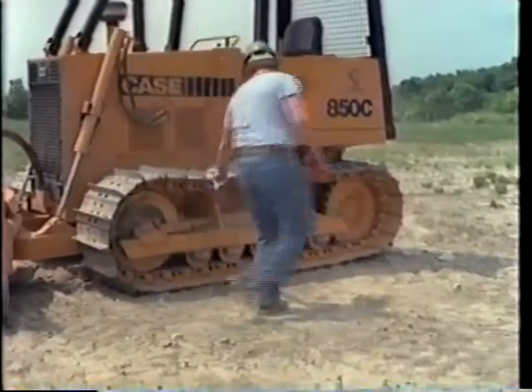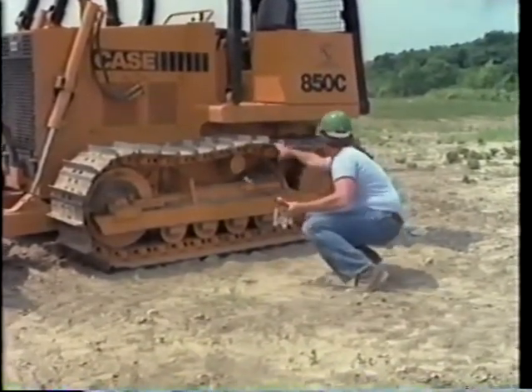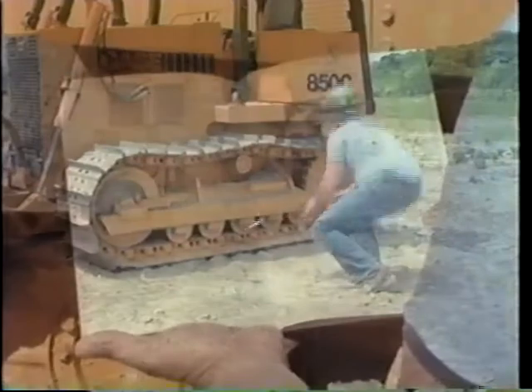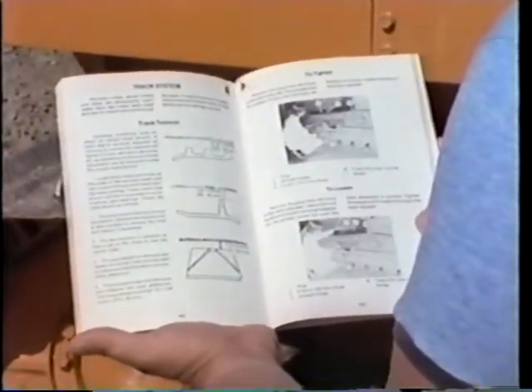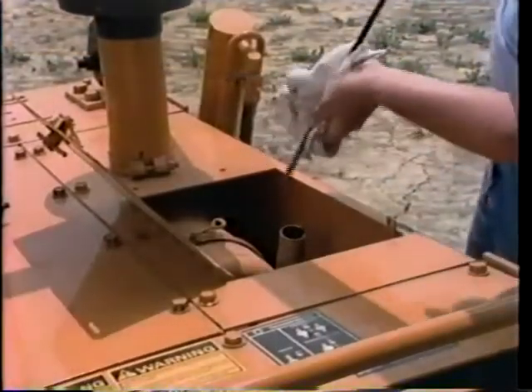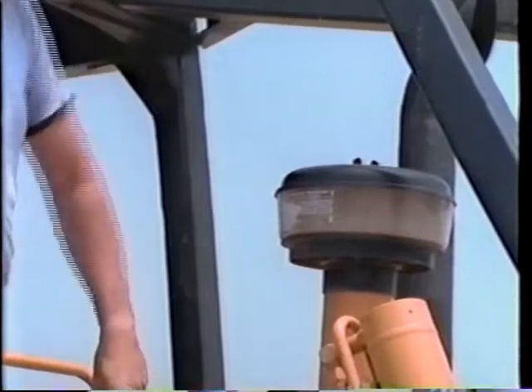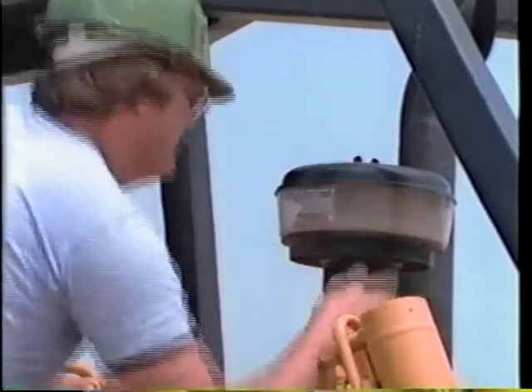Give a quick check of the track tension. If there's too much slop, excessive wear occurs. The operator's manual explains how to tighten the tracks — it's very easy to do. Next, be sure there's enough engine oil. Then clean the air cleaner dust cup, which is right in the same area of the machine.